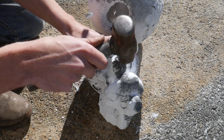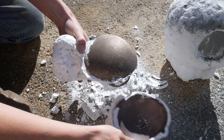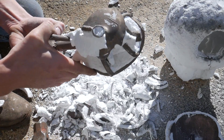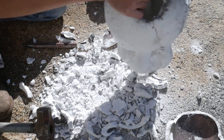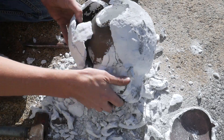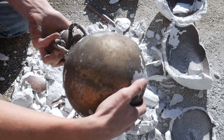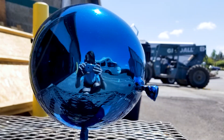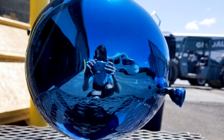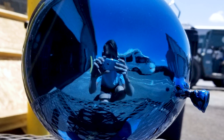All of that work was for this one moment — undressing the bronze of its ceramic casing and exposing the completed casting. This is going to be pretty exciting, or a little disappointing if everything didn't go as expected. In this case, everything came out about as good as I could have expected. You still have to be pretty careful not to hit the surfaces with the hammer — bronze is pretty soft and fragile in this state and you don't want to damage the surface. This one especially, because it's smooth and you'll notice dents right away on a continuous surface. And there's the majority of the balloon. That concludes part one — there's still a ton of work left to do: sand blasting, removing the sprues, welding, polish, and paint. These projects take forever so I don't upload very often, but like and subscribe and check in maybe once or twice a year.